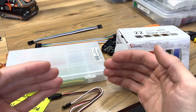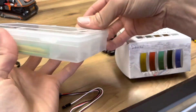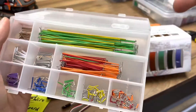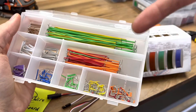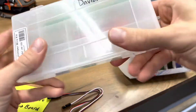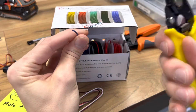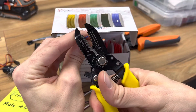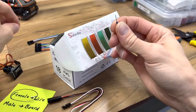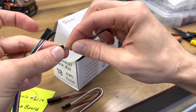Before you use this tool, ask yourself: do you really need it? Parts like this come off the shelf in many different lengths, and they offer extensions for common actuators like Futaba-style servos. If you're doing quick and dirty prototyping on a solderless breadboard, 22 gauge single conductor wire can do the job for male connections. These kits are nice, or you can get a spool, use your 22 stripper, and get the same contact that plugs into DuPont connectors.